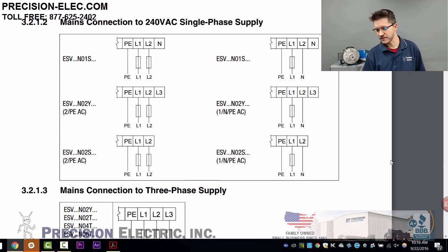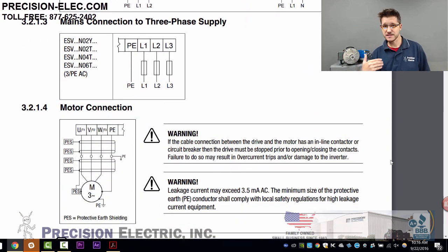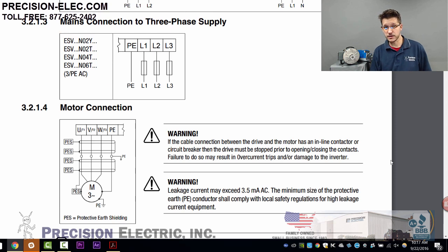So there are three different options you can have. If you have a three phase drive, it's going to have a T or a Y, since Y will accept three phase or single phase and T accepts three phase only. You can technically wire single phase to a three phase drive, but make sure you read or watch the video on derating on our channel before you attempt anything like that, because you can damage the drive if you don't properly derate it for single phase input when it's normally rated for three phase.